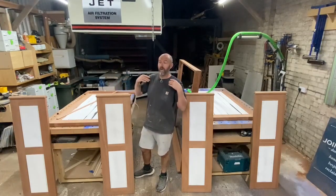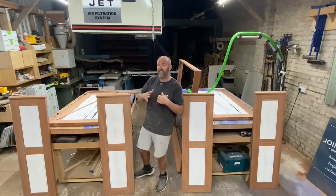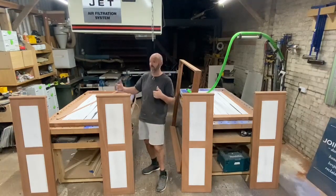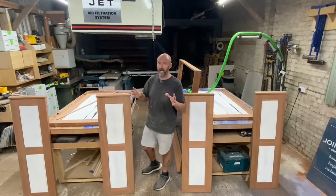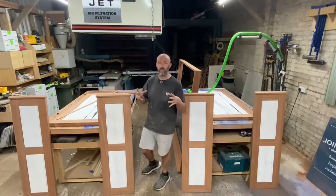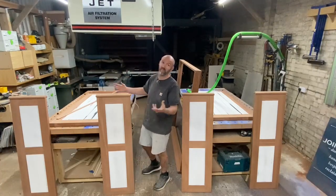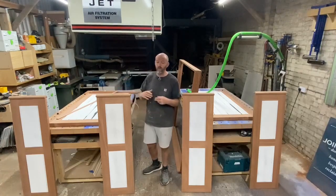But the reason I haven't done is because these jobs, really, you sometimes need to have a little bit of allowance for error as you go. And that's really where the art is, just adjusting things as you go. If I'd tried to do it all on CAD and got it delivered as a kit, and then glued and assembled it, I'm fully committed then that if I make a mistake, I've then got to stop and machine something, and I haven't really saved any time, because you machine things in batches.